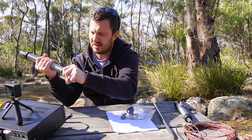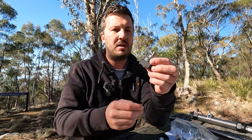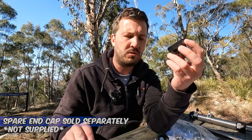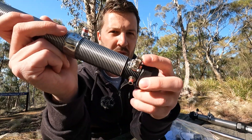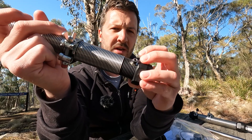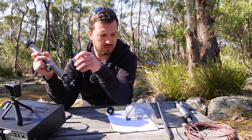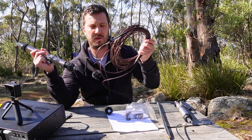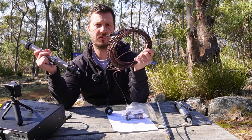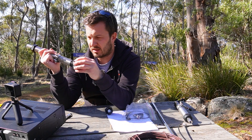At the bottom of the coil the cap unscrews and there's a threaded nut. It's supplied with a blank spare — I've drilled out mine to mount it on a tripod. There's a BNC connection for your coax, and two banana plugs: the black one goes to a counterpoise. I've made up about five counterpoise wires, each about four and a half metres long with a banana plug on the end.